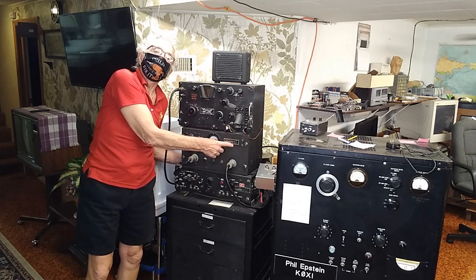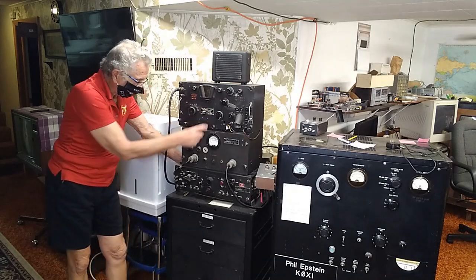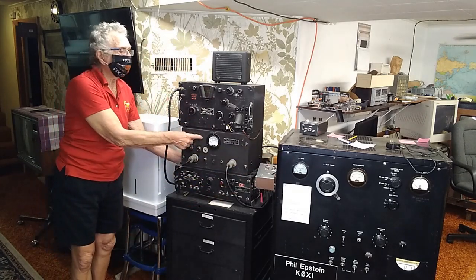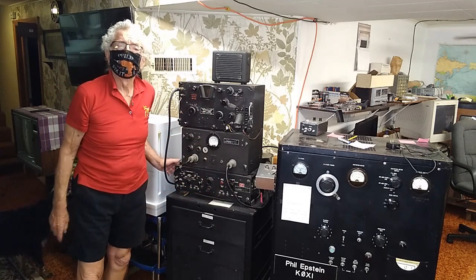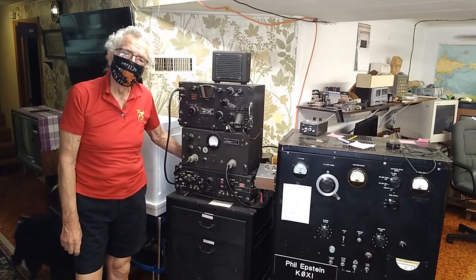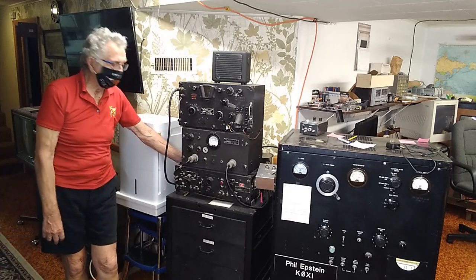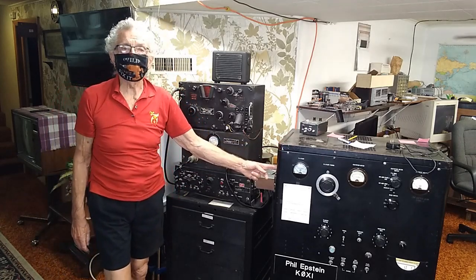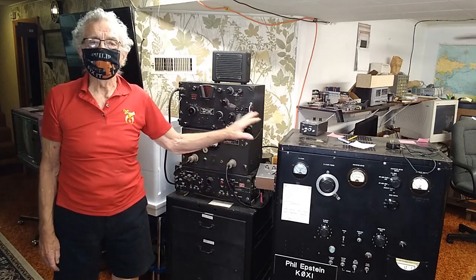There may be some of you military men that recognize these numbers. This is a BC-342. This unit interconnects the transmitter, the speech amplifier, and the receiver. This unit can be switched from house power or to a PE-95 genset. The PE-95 was a portable field generator, generating either 220 volts or 120, 110 AC. That's how this unit worked. This is the transmitter, the BC610 transmitter, and this is part of a complete command station or command post.